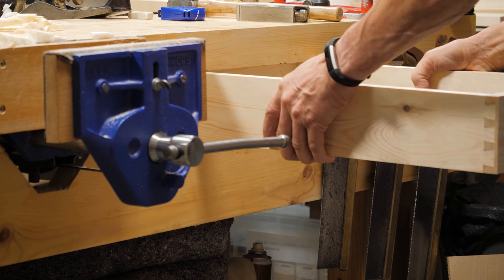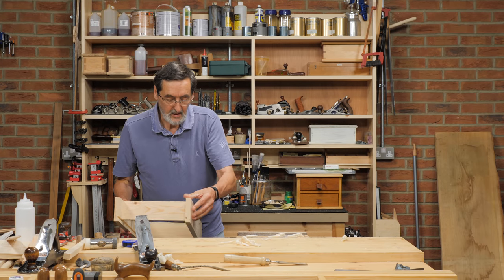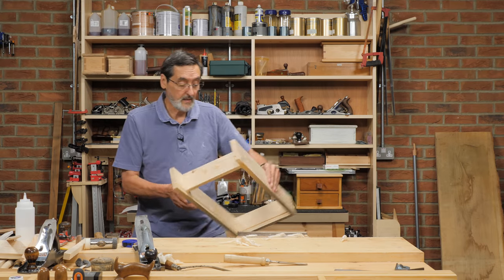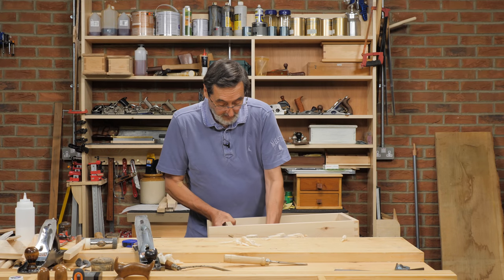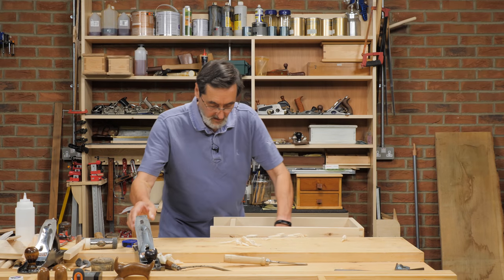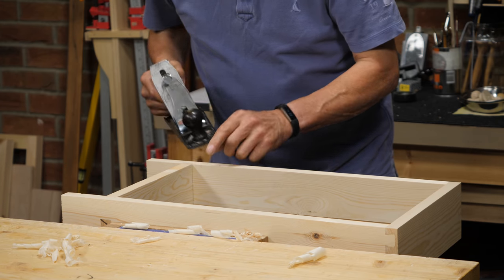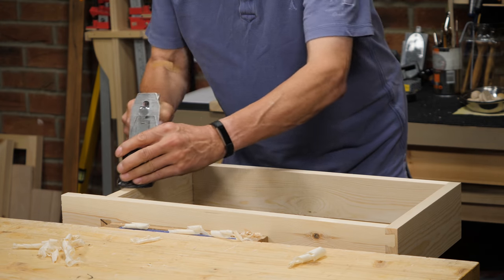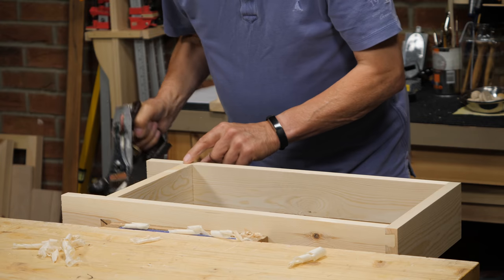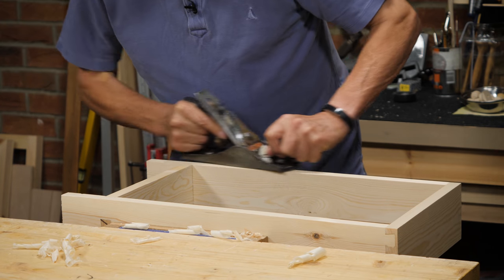It's very, very close. I suspect that this is the height. I feel like it's sticking on this side. I can take it off the bottom or I can take it off the top edge. I'm going to plane that flush anyway, so I may as well get that done first. So how we deal with this is just a fraction of a mil above here. Come in gently. Don't drive at this really hard because it can cause an issue.